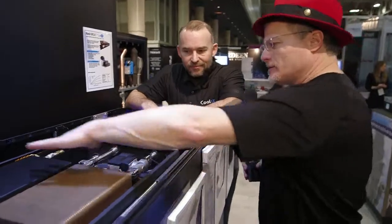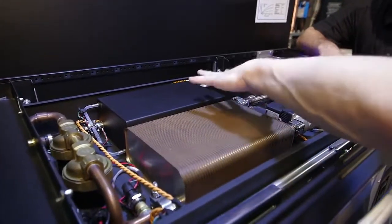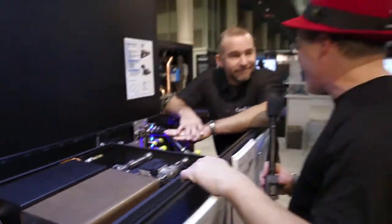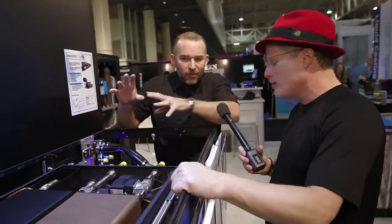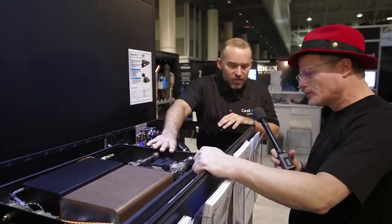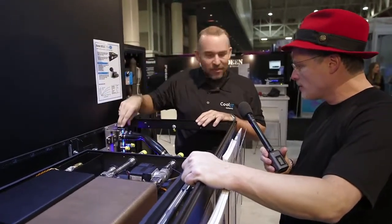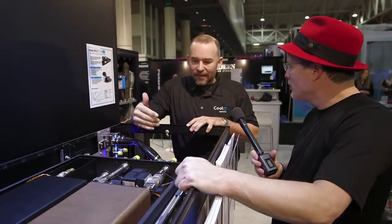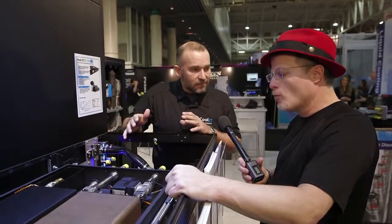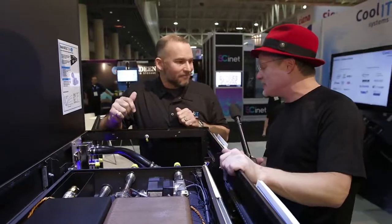This device on top is a 2U form factor. How much can this 2U heat exchanger handle? If we're doing just one, two, or three racks, this is the right solution. This 2U module plugs right into the rack and connects into the manifolds. At an approach temperature of 30 degrees Celsius, this unit can do 40 kilowatts — a major full rack of 40 kilowatts. That is a very dense rack.